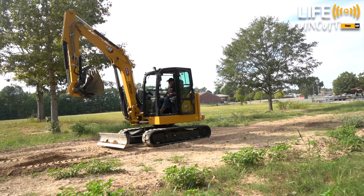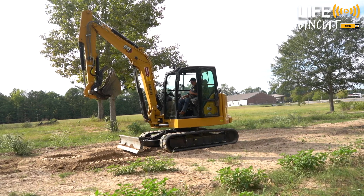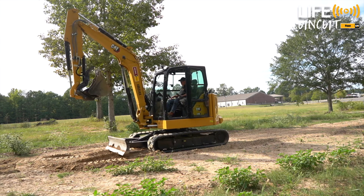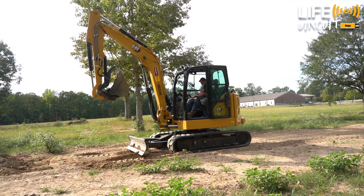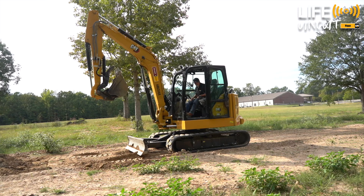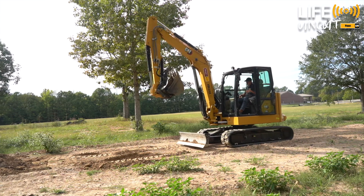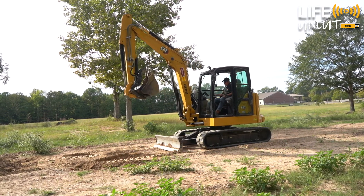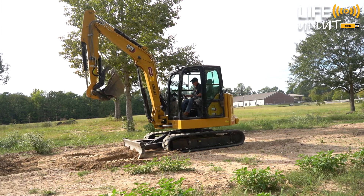Now I'm not touching anything. To stop it, I can either pull back on the joystick or hit the button — whichever way you want to do it. I find it's about as easy just to hit the joystick and deactivate it and you stop right there. I've also used it before for grading. So we can start moving forward, activate it, and now I can use my blade and kind of watch what's going on and float the blade as I need to — that's one less thing I've got to worry about.